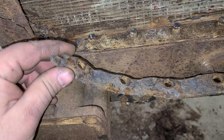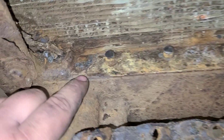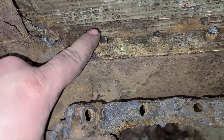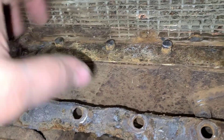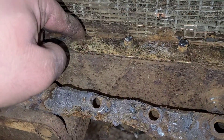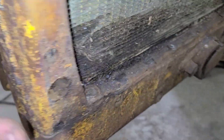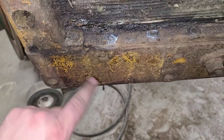Here's what we ended up with — we did end up bending it pretty good, but as you can see there's not a whole lot left of it anyway. Still a small chunk that has kind of fused itself together with the bottom, and we'll get that off later. I also have probably a good 3/8ths worth of bolt to grab onto to get the rest of these out — so that should work out well. I'll probably just put a little bit of heat on each one, let that sink down, maybe heat it again for extra insurance, then grab a hold of them and they should come right out. We need to move on to the front side, get that one pried out, and then we should be able to take this bottom casting off.